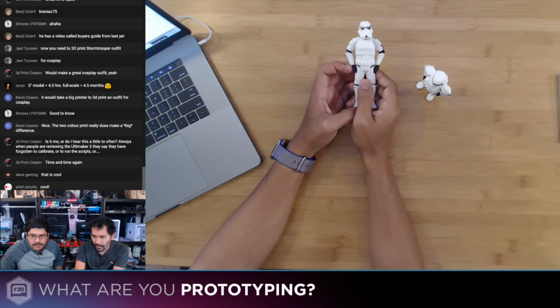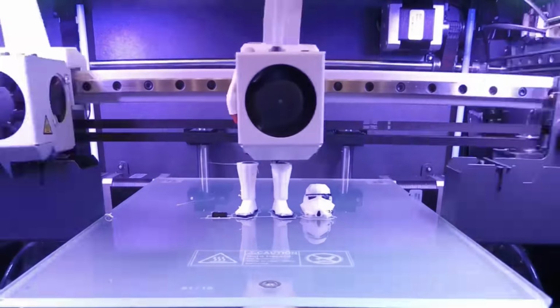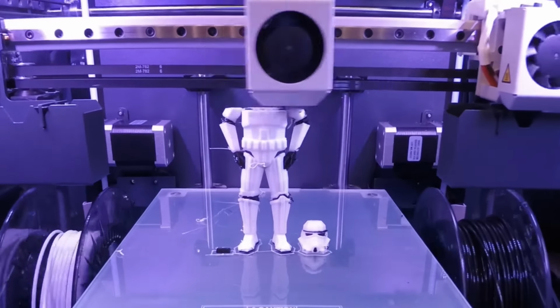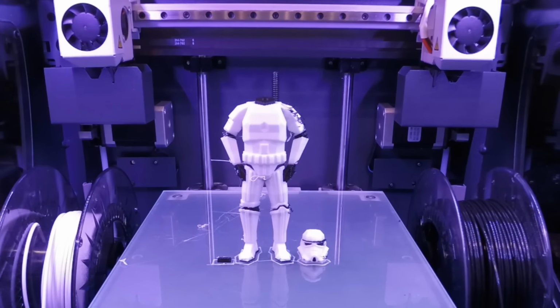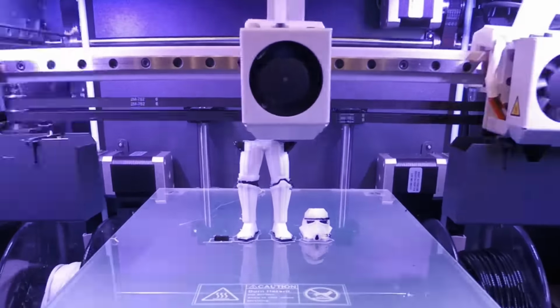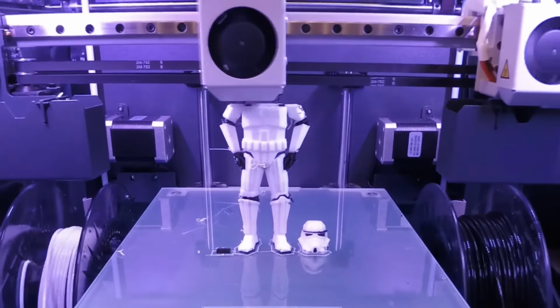Oh no, I wasn't showing you guys. Sorry. There you go. Take a look at that. Yeah, it is a little bit hairy when it printed, and this is with upping the retraction and the tool switch retraction from 6 to 10 millimeters, and it's still hairy, and the temperature was at 190 degrees. That's a little cold. Compared to what we usually print, usually we're printing at 230, 240. So this is way cold compared to what we usually do.